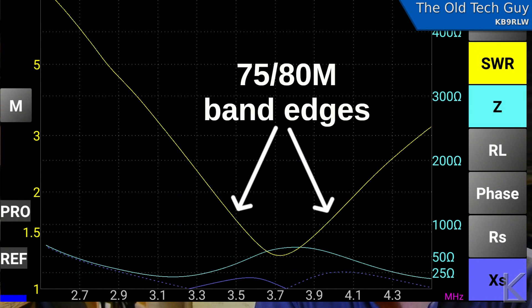I did scan the antenna with the VNA after removing the ladder line. Here's a shot of the 80-meter scan — as you can see it's very broad-banded. I don't know if that's a common characteristic of these antennas. Looking at the scan, the SWR is very low all across the entire 75 and 80 meter band, which is kind of what I was trying to achieve with the fan dipole experiment I'm still going to play with. I wonder if it's broad-banded because the feed point is 20 feet off the ground, with the other end going to a tree probably 25 feet up.